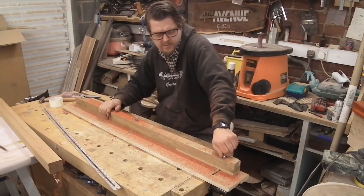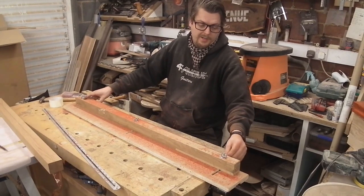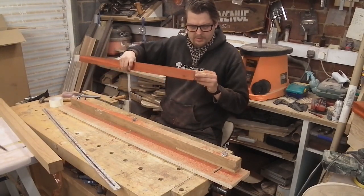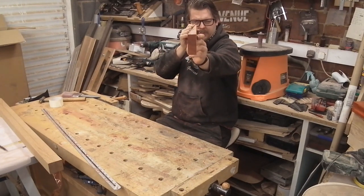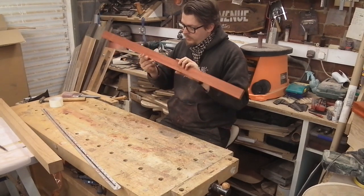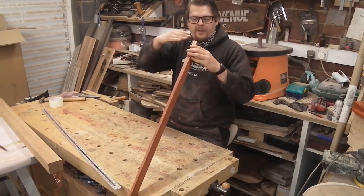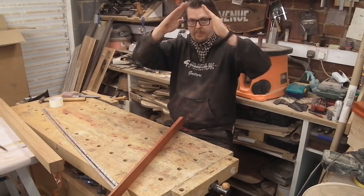So I need to take this wedge off here. This demonstrates just how strong the masking tape and super glue trick is — that's all I've used to attach it. That's a nice straight taper. So I need to plane this face down nice and smooth; it's got saw marks on it. Looking at the grain of this, I followed the slight angled grain when I was doing the cut, so I made sure it runs as straight as possible up here, and it's almost perfectly flat across the middle. So the grain with the neck will be flat and then taper out towards the sides of the neck.